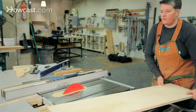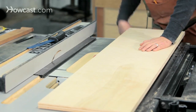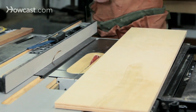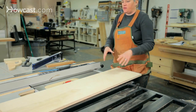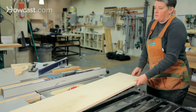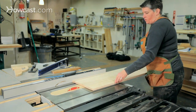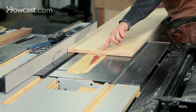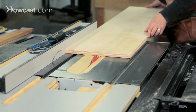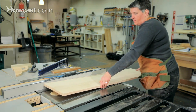Let's move on to ripping. Ripping involves making a cut down the length of a board. Because you are bound between the fence and the blade, it can create a dangerous situation that can cause kickback. There are a couple of techniques with ripping wood that you need to follow to prevent that. The idea is that you're pressed up against the rip fence — that's what you're indexing off of to make a cut. This edge has to be straight; there's no way to do this cut safely if that edge is not straight. With that straight edge against the fence, you push it through the cut.